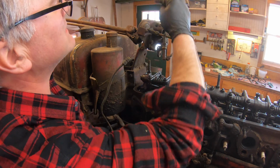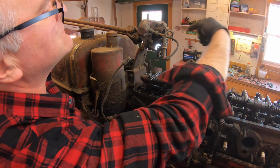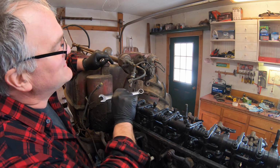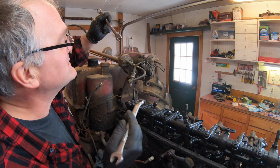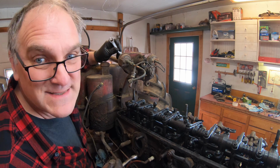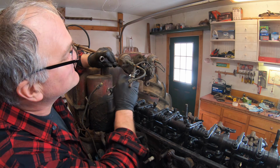Now I got to take this assembly which holds the gauges, the diesel throttle control, and the steering shaft off so I can pull the head straight up. I think that back in the day when International made these tractors, they really thought about the farmer maintaining them a lot. For instance, if you run into a nut and a bolt where you need 2 wrenches to take it off, quite often one side is, well in this instance, 9/16 and the nut is 5/8.